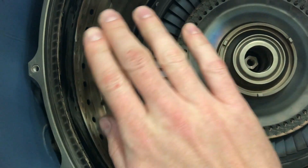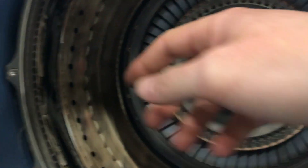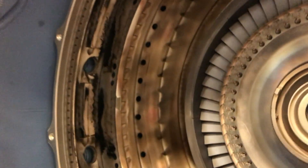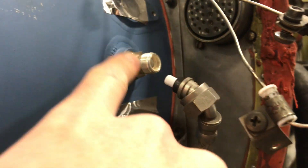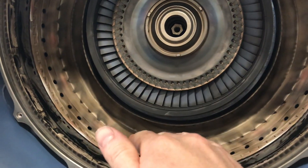Picture the inner liner as a wall right here — air fills up in here and this is where it gets mixed with the fuel. All these little holes you see, and on the outside where they're taped up, are where the fuel nozzles go. The nozzles are out being cleaned right now. The fuel gets sprayed pointing backwards. There's one igniter right here and another one down on the other side — two igniters total, used for starting and for operation in extreme weather.